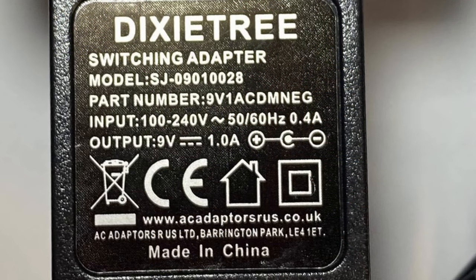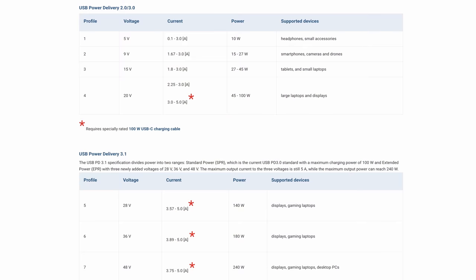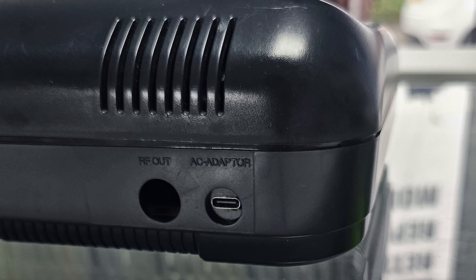One of the biggest downfalls of today's retro consoles is powering the devices up. Back in the day USB-C didn't exist, and we had to power our retro consoles from things like custom DC barrel jacks with the positive on the outside instead of the inside, which is no longer standard, or mains power supplies that vary from country to country. So accidentally plugging in a 220 volt supply into a 110 volt Dreamcast could blow up the console. Thankfully we live in an age now where USB-C is pretty much capable of powering every retro console. On that note, I've invented a brand new range of products called the Clean Power, which will be going into every single retro console. Starting with Dreamcast, I've already made the Clean Power for the Mega Drive 1 and 2, the Master System 1 and 2, the Atari 2600, and the Sega Saturn is also in the works. So expect to see a lot more consoles rolling out very soon.